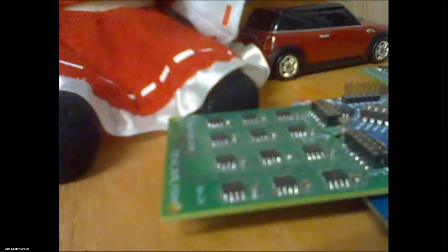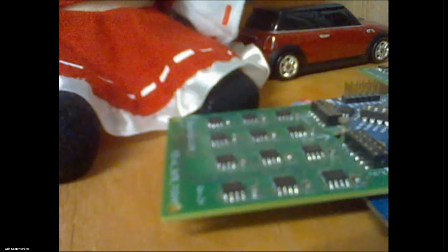96 megabytes. Yes, it's kind of slow because it's 8-bit, and at the higher frequencies you can't do it in 2 cycles. You have to do 3 cycles per byte. So it's only about a third of the throughput of the Edge, but it is 3 times the capacity. How can you say no to that?